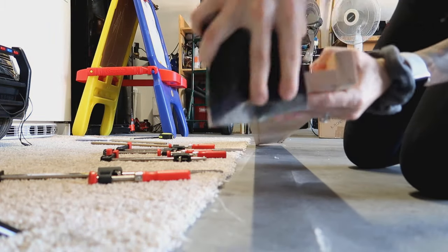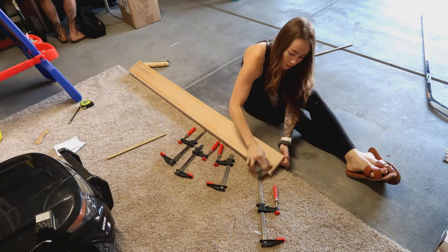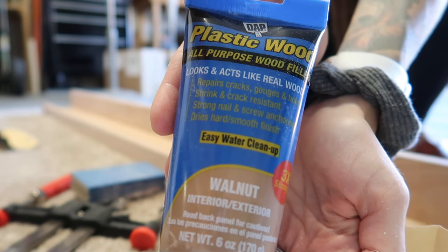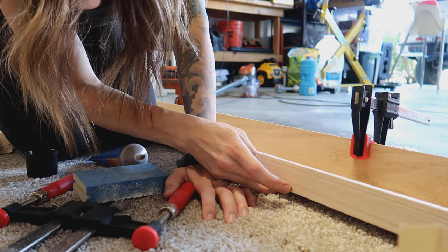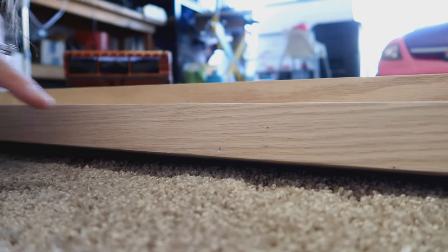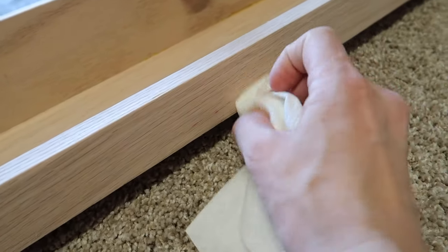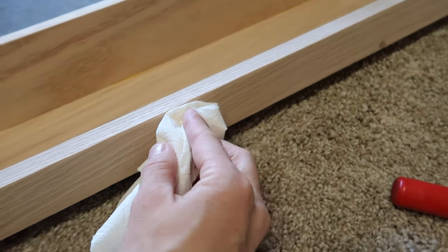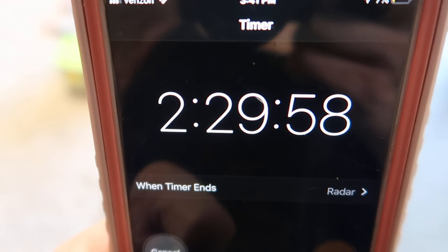Now I'm going in with the wood filler in walnut color. I'm applying a little bit to my finger and dabbing it on the areas where the finishing nails were — in the front lip only, not the back piece. I'm putting it on each little hole, just as if I was patching a little hole in drywall with spackle, then wiping away any excess with a paper towel.